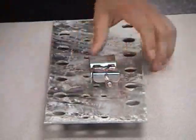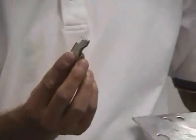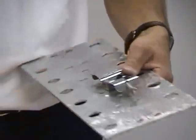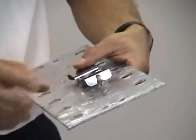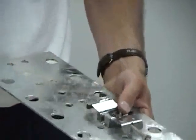See, I have an insert in there — the insert looks something like that. That's going to come with the butterfly hangers for the smaller sizes of cable. It's to keep the cable from slipping inside that slot that's there. On the larger sizes like the LMR 1700, you won't need it because the slide is big enough to where it won't go in.